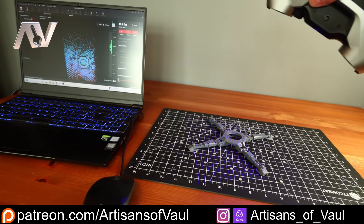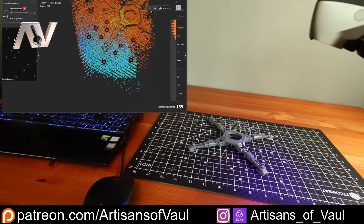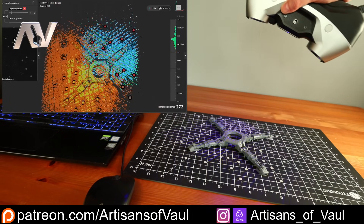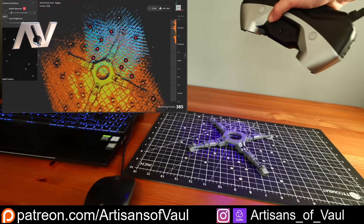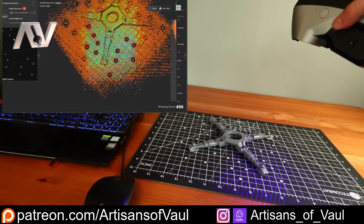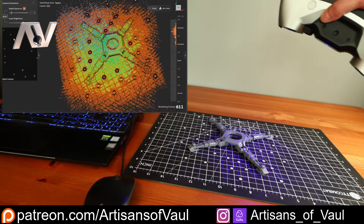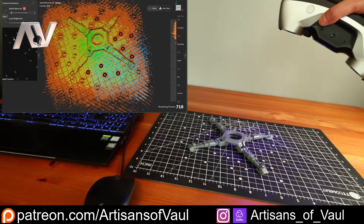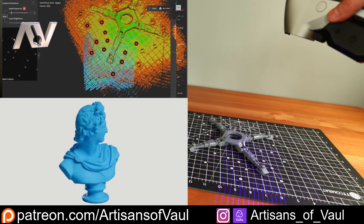Once you've set up, you just click Start Scanning and you're ready to go. I've got a more detailed video on using the Revopoint software — it's really nice to use. For laser line scanners it's very clear: you just keep scanning, slowly going backwards and forwards. It's going to measure the markers, and you'll notice them turning from orange to yellow, and then eventually green. You want everything you're interested in to be green, meaning it has an appropriate level of detail. You can also get a mobile kit that lets you connect the scanner to a small handle and your phone, making it easier if you don't have the object right next to your computer.